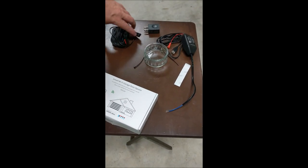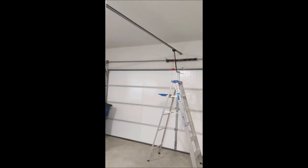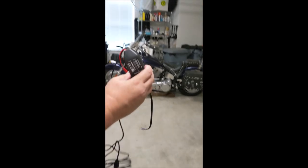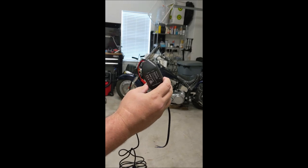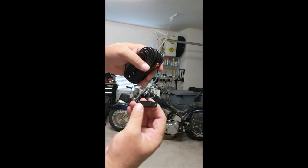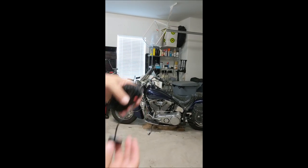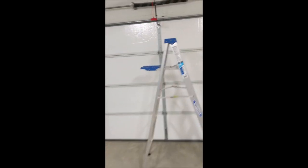So the first thing we need to do is install this sensor. This sensor is going to go on the garage door over here, at the top of that bar. This is going to tell this unit over here whether the door is open or closed. The problem is you don't want to put this sensor so close to the garage door that when it opens it hits it and rips it out of the wire. So what I've done is I've done a test over here with a little bit of tape and the magnet.